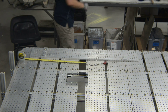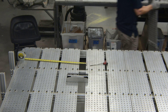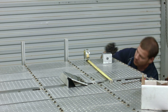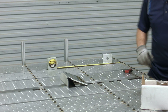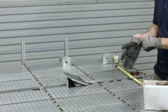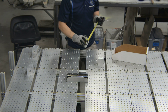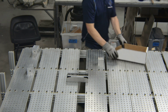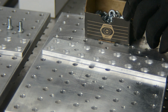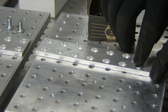This can save money and time for prototyping and custom work. Our fixture table was designed and built by us using our CNC routers. If this tool is something you need in your shop, we have free prints and 3D models which can be downloaded from our website. The table was designed to work with the number 10 series extrusions provided by 8020 Inc. You can download 3D models of the extrusions and other related parts from 3D Content Central or directly from 8020 Inc — a link is in the description.